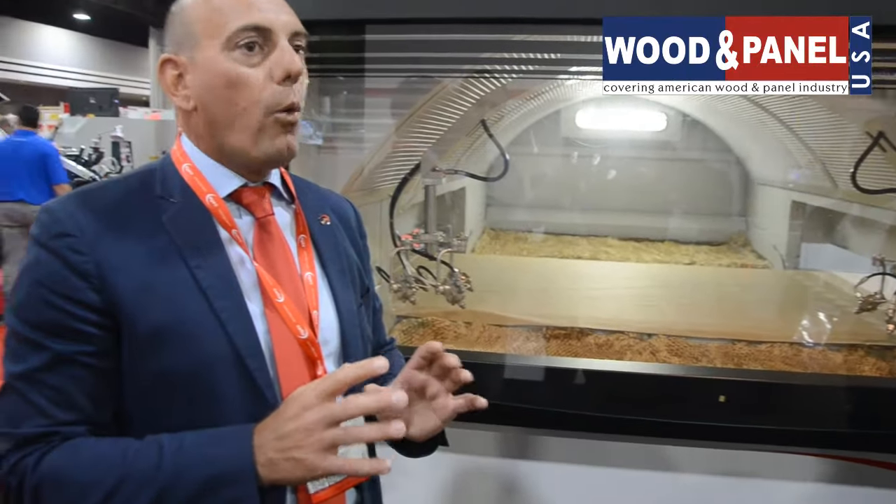The ability, when the panel is arriving, to have that panel totally being sprayed by one gun, and then it gives the time for the lacquer to distend, to evenly cover the surface, and then the second gun is going to start doing it on the other part. So it is a way of spraying that absolutely gives us a very high quality.